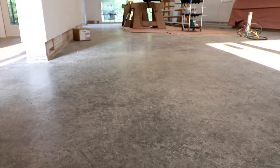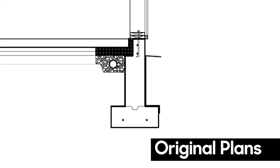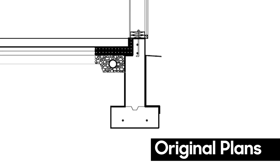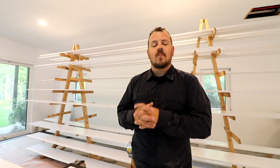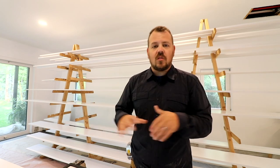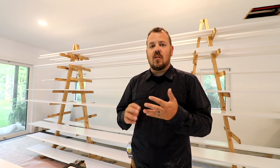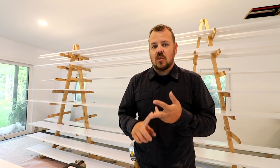The plan called for a poured footing that came above grade and had basically a brick shelf — a notch in it. On that brick shelf, which points to the inside of the foundation, we have insulation on the vertical leg from the bottom of the brick shelf to the top of the wall, and then two layers of insulation underneath the slab. That concrete slab is completely thermally broken from the outside in every way — it doesn't connect to the outside, only to insulation and indoor conditioned space.